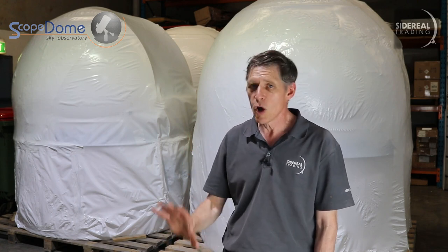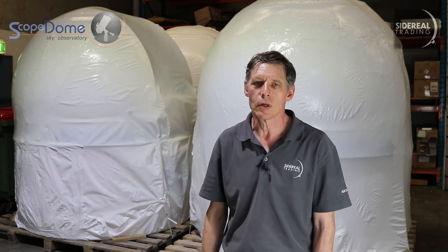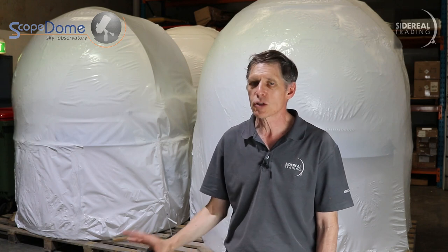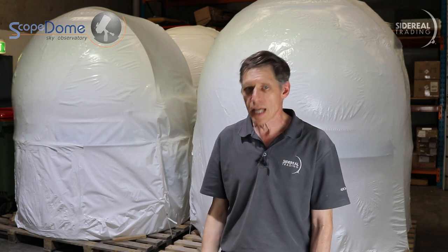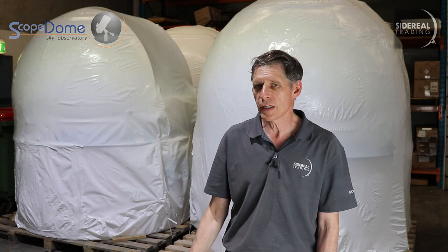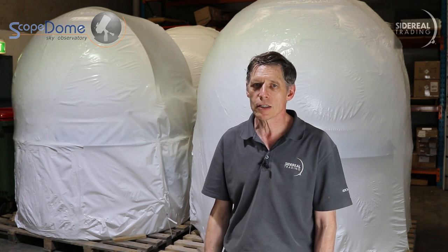Because it's a complete dome, there's no big box of additional motors, cables, panels, and all that stuff you have to assemble. That does mean that the unit itself weighs a chunk, though — it's about 250 kilos. For transport, we obviously prefer a truck, but you can put it on a trailer that can handle the 2 meter pallet. Lifting it on and off the trailer is going to be a bit tricky, though. You can lift it with a forklift and move it around with a pallet jack, depending on the surface.